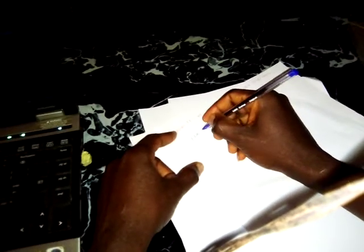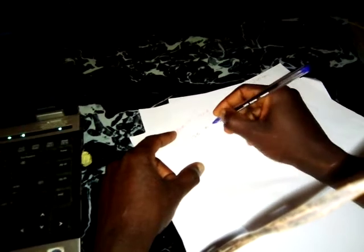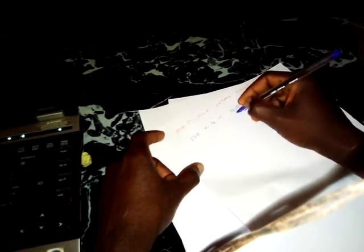For the case of my television or my decoder, it's drawing about 120 watts per hour. Electricity is calculated in kilowatts, and I'll make a future video on how to measure your appliance wattage. But for now we're learning how to size our solar power system. So: 120 watts multiplied by 4 hours gives us 480 watt-hours. We need a solar power system that handles around 480 watt-hours.